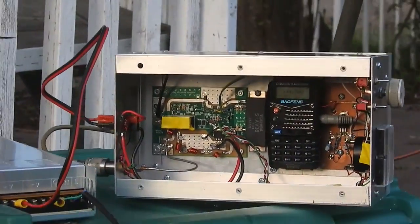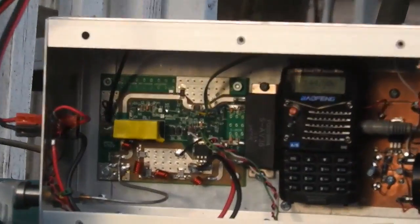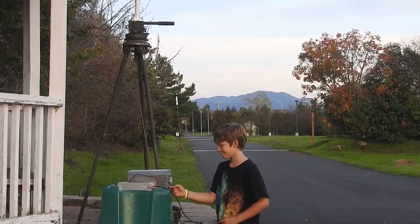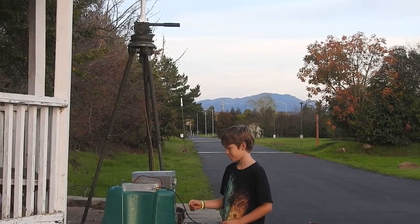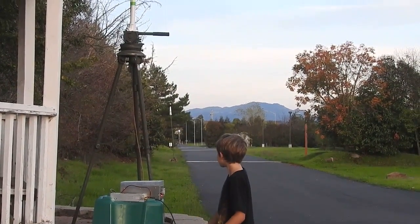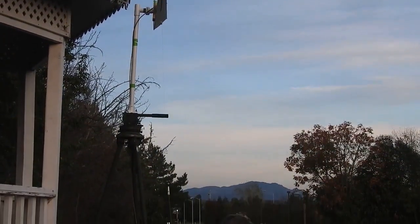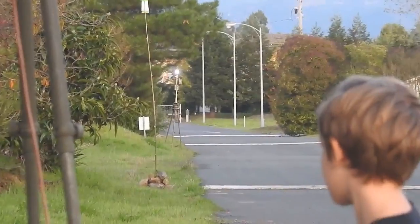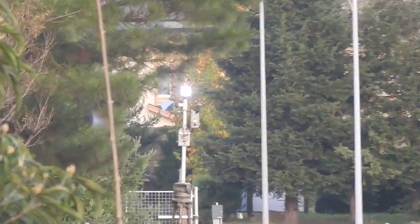Also, a low power hand-held drives a Toshiba 80 watt brick as a transmitter. Turn on the transmitter, and the LED at the far end shows it's receiving power, by way of the 100 meters of number 28, 0.013 inch copper wire.